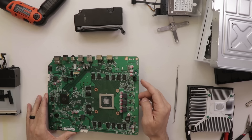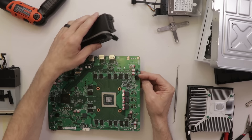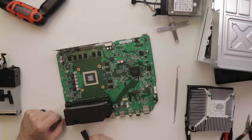Interesting note: I think the reason the board was damaged is because this pin right here on the power supply goes right through that hole, and if it's misaligned and you screw it down, it could smash those layers together enough to cause exactly the problem we had. So it could have just been somebody reinstalling the power supply incorrectly. And now it's time for the moment of truth — I'm going to plug this in. Hopefully nothing shorts out and nothing smells burned.